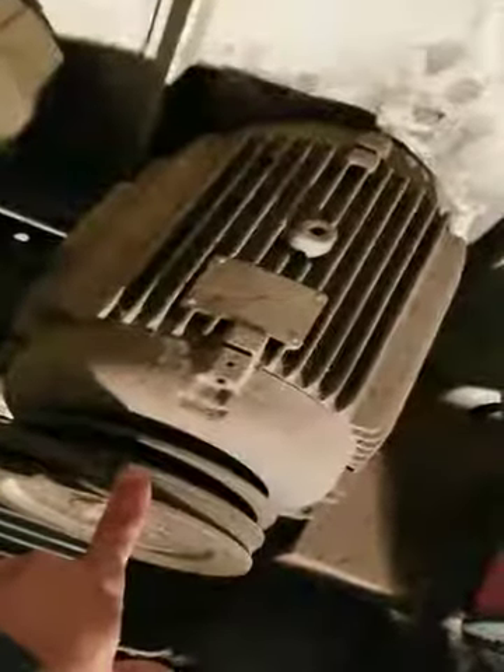It's supposed to be running at 1750 RPMs, which this motor runs at. So you would have to get a pulley equivalent to the size of this one, or you could downsize this pulley. You'd probably want to run all these at the same RPM, so 1750 RPM would be ideal.